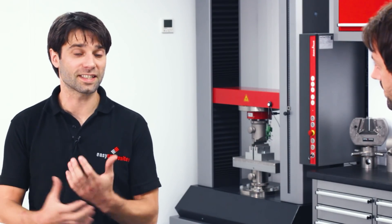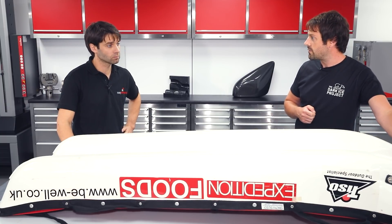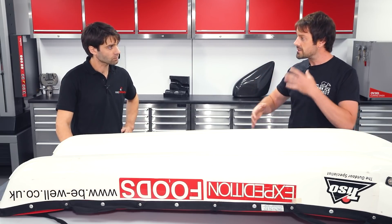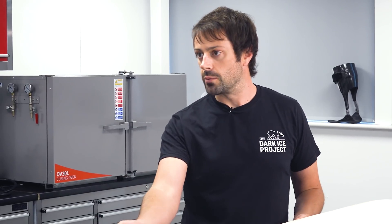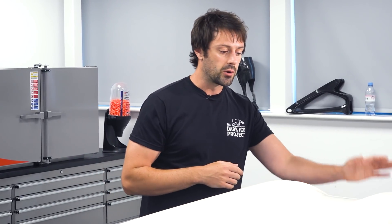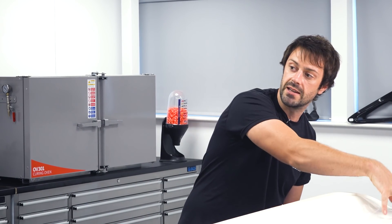In terms of actual structural strength, what are the key attributes you need? Is it stiffness or impact resistance? The three things that really need to be on point are: first, impact resistance — if you smack into a piece of ice at the front it needs to withstand that and not hole, so you don't have water pouring in when you cross the next lead. Second, it needs to be as light as possible because I'm going to be hauling this for a very long way. Third, it needs to be stiff enough to retain its shape when it's got a huge load inside. Is the nose where the brunt of the impact is? Unless you're doing something very daft, yes — mainly the nose. If you drop off a large pressure ridge nose-first with hundreds of kilos inside, it needs to be strong there, and also for what I call a belly flop where the sledge lifts over a rise and thwacks down onto a sharp piece of ice.